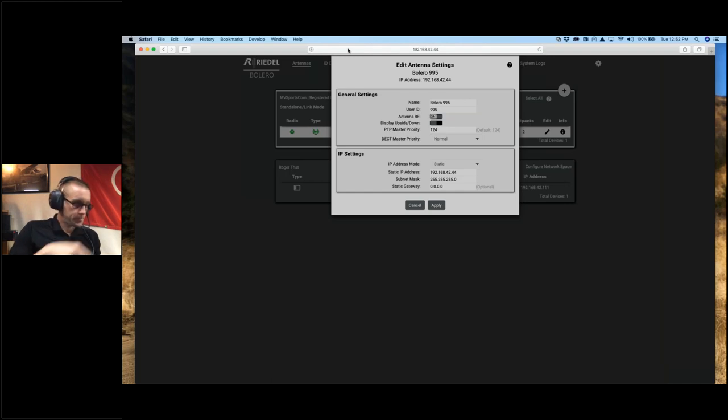Like if your three antennas were right by your frame there, barely on a network, right? You want the least amount of hops from your master to your slaves, and the vast majority of them. So if you've got a spine and leaf situation, you want that attached to the spine or the core, or something that is the core, if you can. And don't worry about it. If you don't change the numbers at all, more than likely you'll find that that's where that person will wind up, because they take into account the network traffic during that election process.